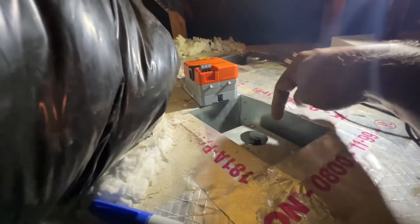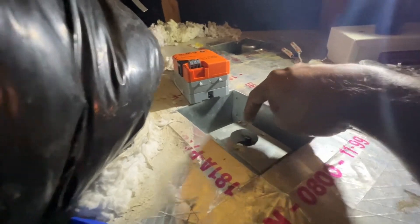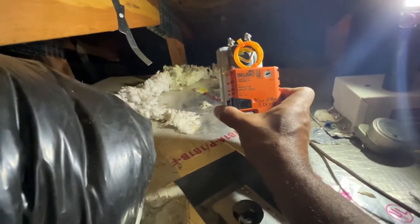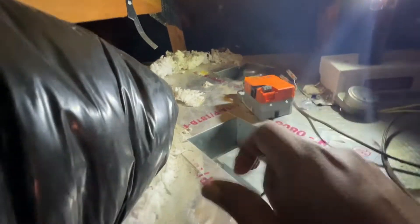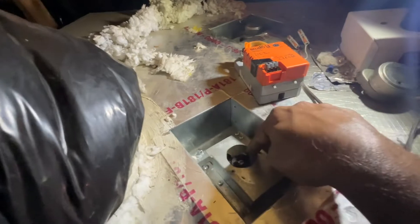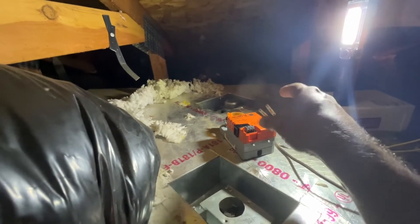I'm going to remove the holder and then the black piece, along with the screws, so I just have the shaft of the damper door. I'm going to use a new device — it's the same price as the Synchron motor. This is a Belimo; this unit can be programmed so it doesn't need a spring anymore. It can be programmed to open and close on command, and my system supports both open and close. I'll mark the closed position and the open position of the shaft.